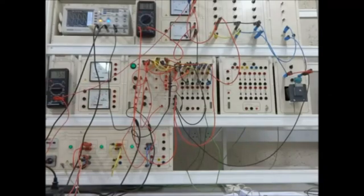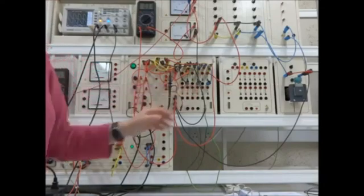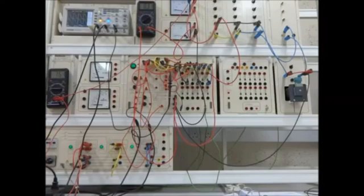When you are doing the calculations for working out the DC voltage for the circuit, bear in mind that the thyristors do indeed have quite a large voltage drop when they're conducting. So the answers you get will not work out exactly as per 110 volts RMS phase input. Right, we'll carry on now to 60 degrees.